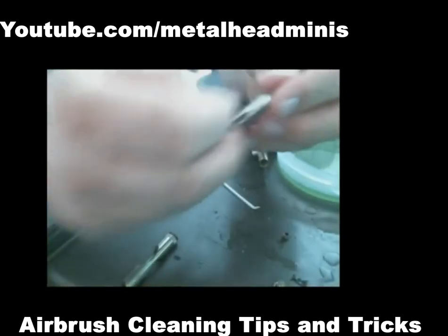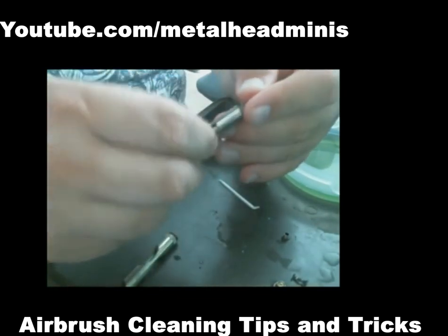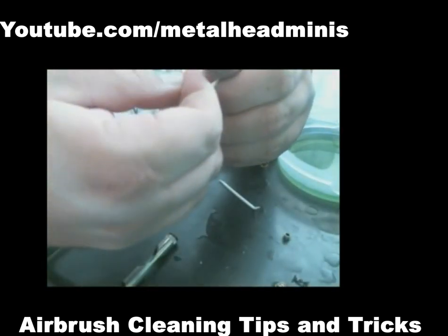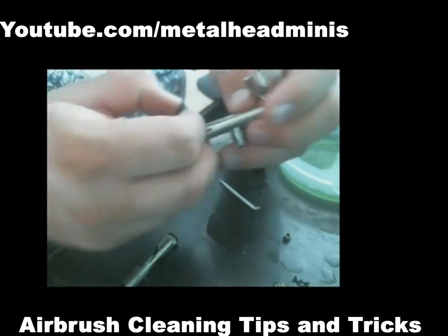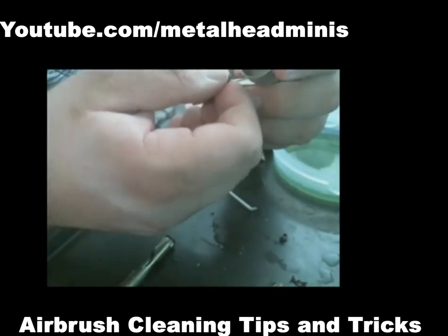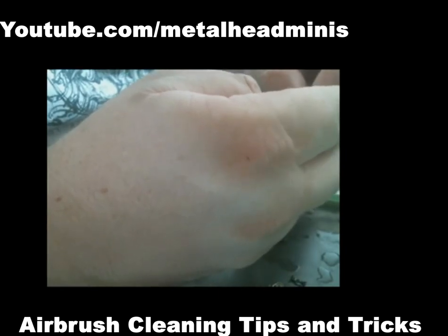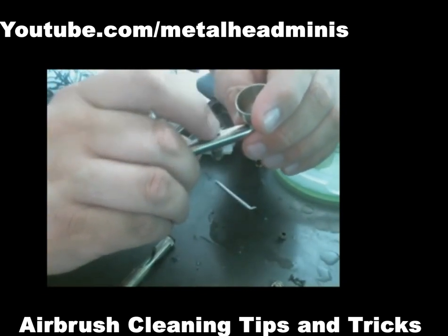Take your trigger. I always have the biggest problem with these because I have really big fingers and these are pretty delicate little small tools. It sits in there with the curved end facing backwards. Grab your trigger. Trigger gets pulled or pushed in front of it and seated on top of the air controller. And then you just want to kind of wiggle it around so you're sure that you're sitting right. And that's it right there. You can see that I've got play and it pushes back up. And then I've got play back and forward.